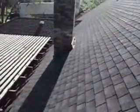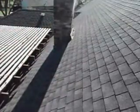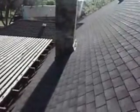That's the rear of the chimney. You can see we have flashings there. Don't have a chimney cricket. They're normally quite important because they direct debris away from the back of the chimney breast and back down onto the roof and off the roof by the water and wind.